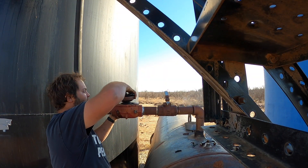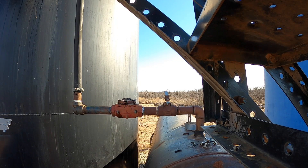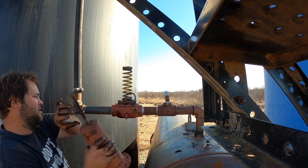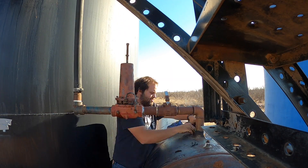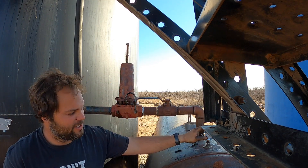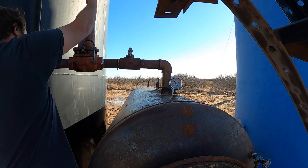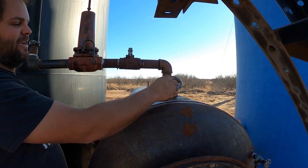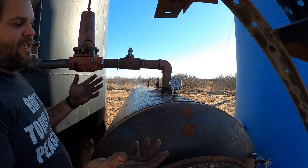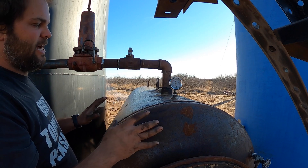So we go gasket, this doohickey, the thing the spring sits on, the spring, and I'll go ahead and start this so we know it's all lined up, then the top housing. I'm going to turn the wells on and let the pressure start building. This thing is up to 15 pounds. I guess this is set about 10 — about as tight as you can get it by hand without a wrench. So if this works correctly, when we open this valve it should be wide open and the pressure should rapidly fall down to between 8 and 12 pounds, then stabilize within just a matter of a few seconds.